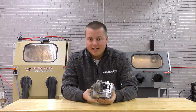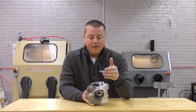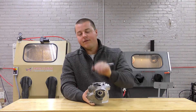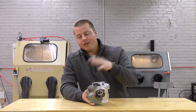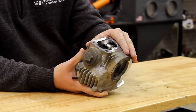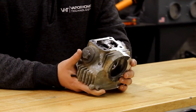And don't tell me glass beading, because I've seen glass beading — the media gets stuck in the aluminum. That does not happen here because we are suspending abrasive in water and flowing it across the surface. So as the old statement goes, where water can go, we can go as well. And that's a huge advantage here in the vapor honing world.